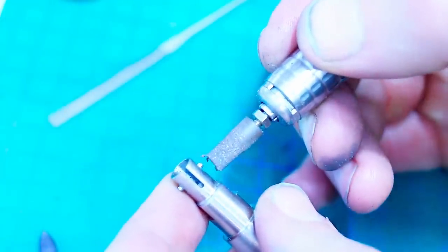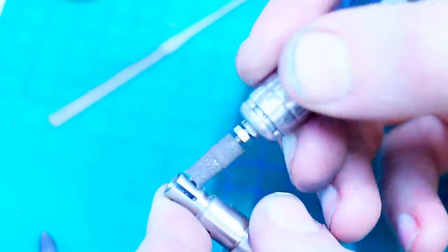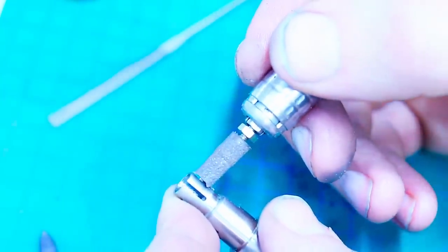And this dimple very conveniently fits over our pin feature in here. And by doing this motion, we will put a nice edge break on it, polish the face and a little bit of the side of this feature, and it will just come out very nicely. And since it cuts relatively slow, even if you have a slip off, the consequences are small.